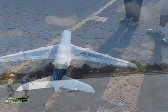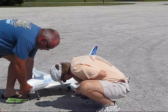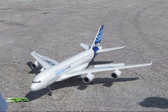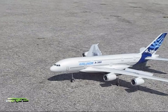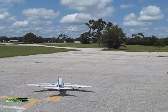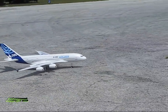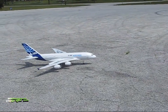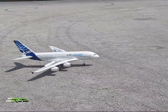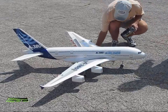Alright Bill, we're up. Lights, camera, action — this is fun. As the gear was spinning, that extended it more. You just have to grind a little flat spot so when you do the Allen key adjustment it won't move on you. Why don't you pull the gear off? Alright, here we go — give us some juice. It's gonna take a long way to get out — it's heavy. You've got to figure that motor out. What motor is that doing that? I'm not sure, but I'm gonna have to put my hand on each one.